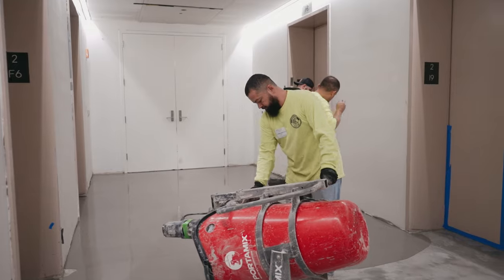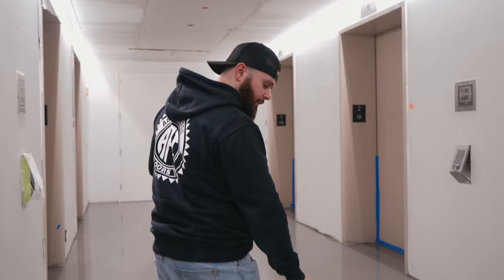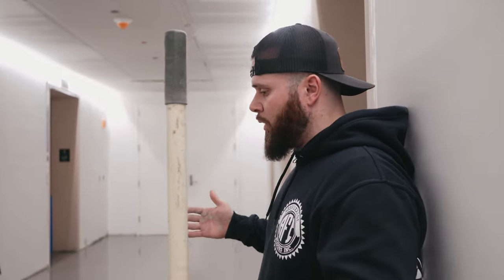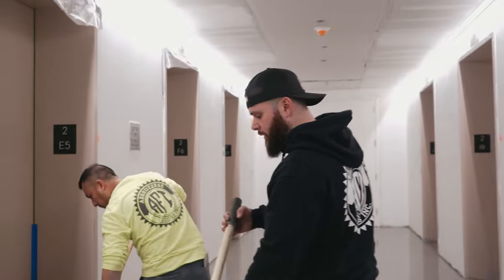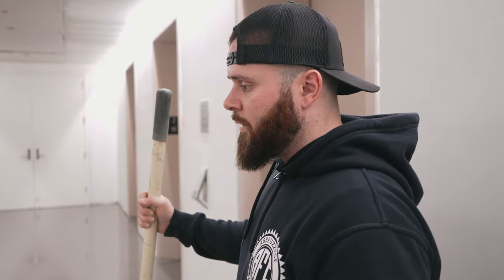The beauty of these floors is that they're not ceramic tile, not porcelain tile, not a manufactured product — there's movement in the floor. You use the smoother to smooth it out, essentially pulling the water line back. On this particular floor, the client wanted more movement, so we're manipulating the water to create extra movement. Every time I go over it, it leaves different patterns. Instead of just going straight across — which would be fine for carpet, vinyl, or linoleum — for a finished floor you want to make it look a little artsy. Get in touch with your crafty side.